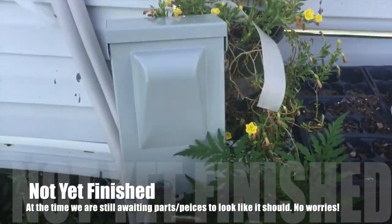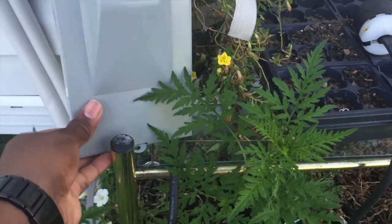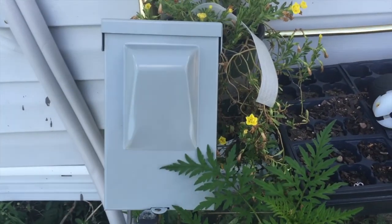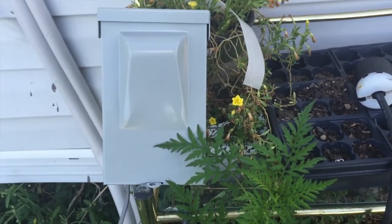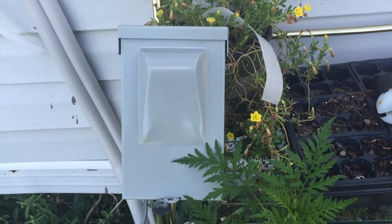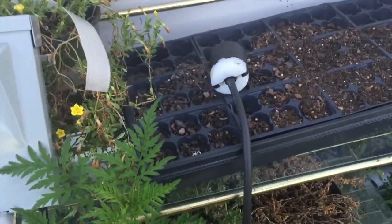Here's what we're going to use that's going to make it a little unique. This is the connection box — it's just a disconnect. It's non-fused because I'm going to be using an inverter to actually power it. It's going to be independent of my 48-volt system inside of the house. It's going to have its own different power system so it doesn't drain my batteries.